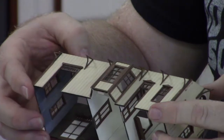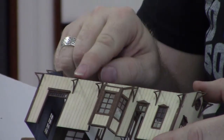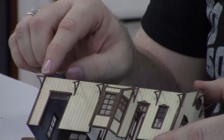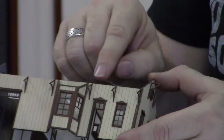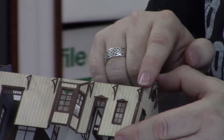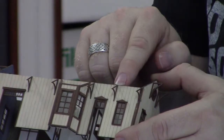And what I ended up doing was basically like I did with the circular window. I came to the first full scribe line on either side of the bay window. I did one just on this side of the door. And then this one here that is now broken will get replaced, but it's out here on this outer edge. And it's actually on the trim itself. I actually notched the trim and put it inside of the trim edge. On the other side over here, like I say, it's on the first full scribe after that. I found one on the edge, and then I picked this one here, mainly because it's more or less on center, but still gives me a vertical scribe to use as a reference mark.